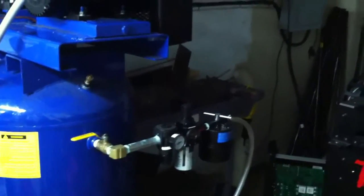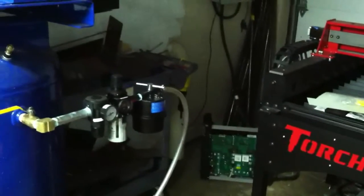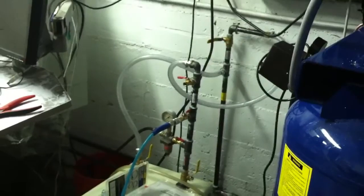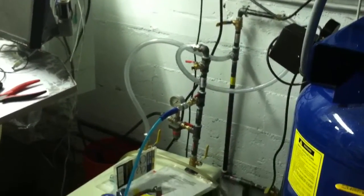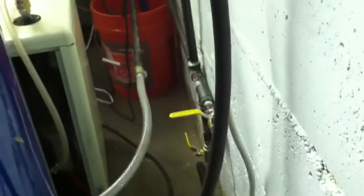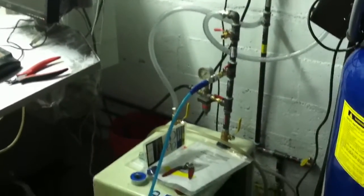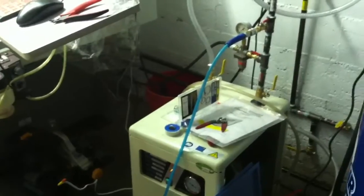I know I should have that motor guard mounted close to the plasma, but I'll get there. I finally decided on going with half-inch black steel pipe, so I've got a more permanent setup now, which is really helpful — I got tired of swapping things in and out. I've run 20 feet of that pipe along the back wall and looped it back, and I'll end up mounting it at an angle so it all drains down. That extra 20-some feet goes straight from the compressor tank to the air dryer, which should help it cool down a bit and drain some natural moisture out. Probably overkill, but I'm looking to have a pretty solid air system.